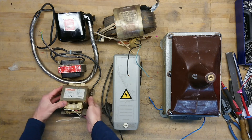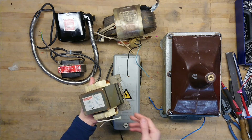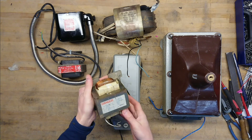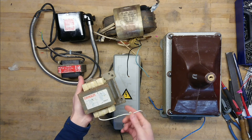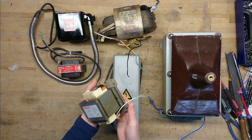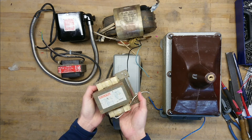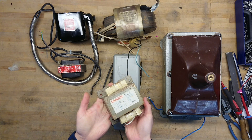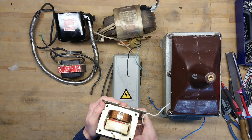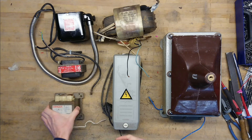Let's start off with the most well-known: the microwave oven transformer. This is a 2 kV AC output transformer at 230 volt AC in. Usually these come in a 1-to-10 or 1-to-20 configuration depending on what country you are in, but these are grossly underrated. They are made to work on the brink of saturation, so dirt cheap that if you run this for over 10 minutes it will start melting and smoking. But they are widely available, or at least used to be, as they are being replaced with smaller, lighter solid-state versions.